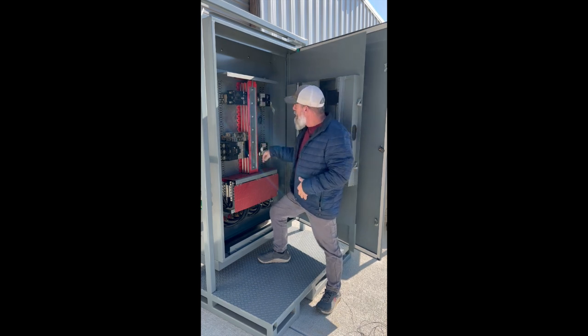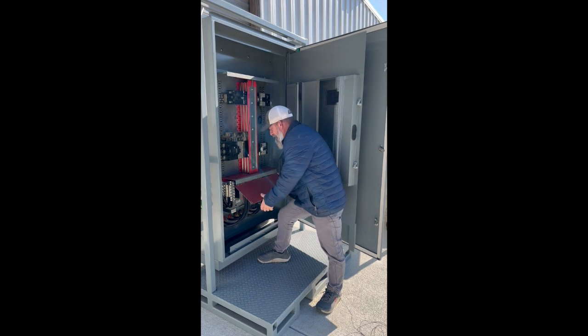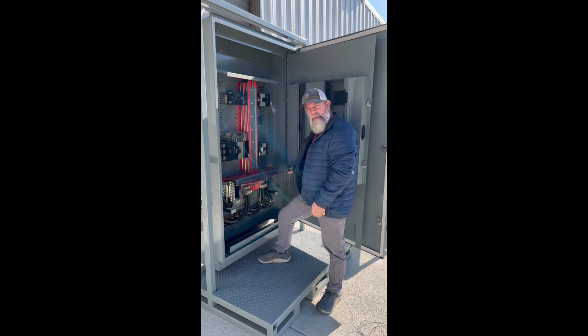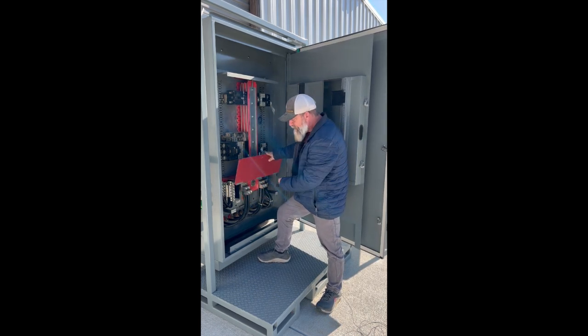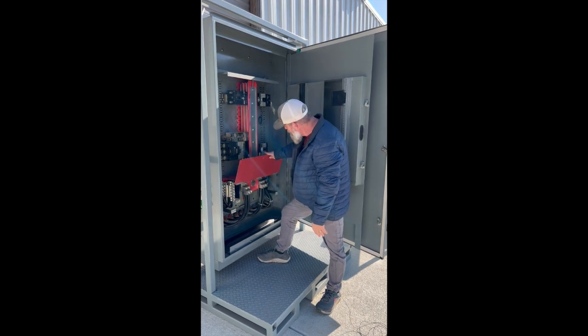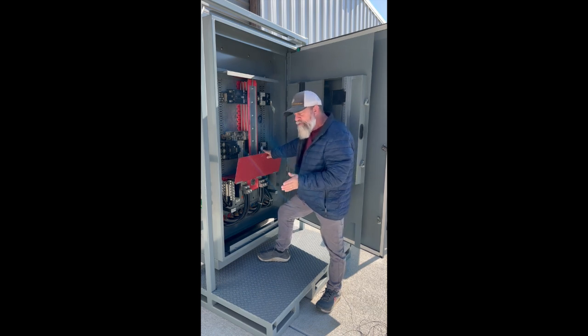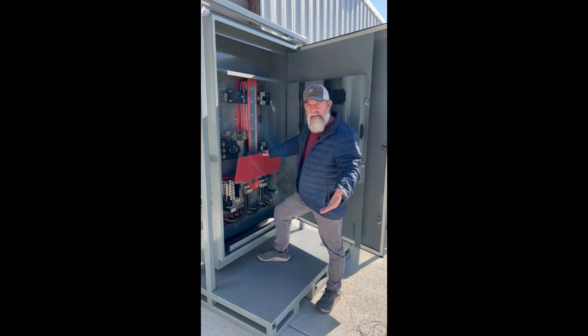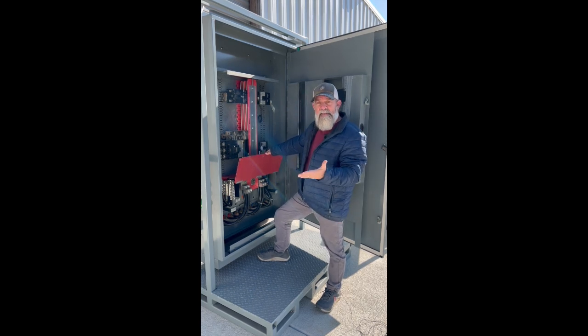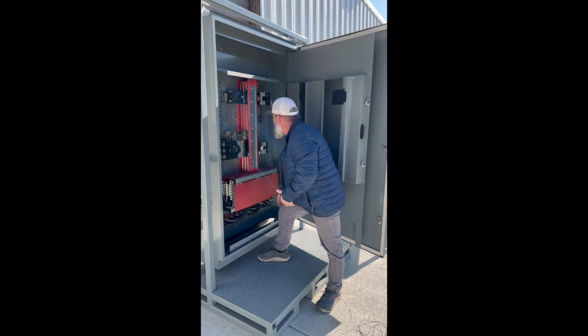You can see this one is in good condition because it's rental-ready. We've already polished the bus bar and cleaned all of the red board — you want this free of debris always. You can see nice shiny conductors. This one's a three-phase four-wire; we say four-wire because it does have your neutral installed — you can see a neutral bar there. A visual walkthrough, just being conscious and aware of what it should look like when it's in good condition — this panel is clean and ready for service.